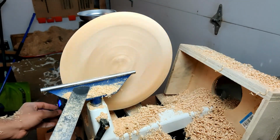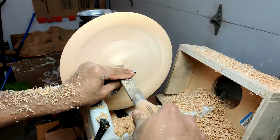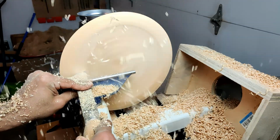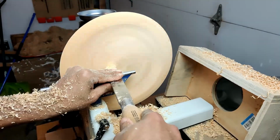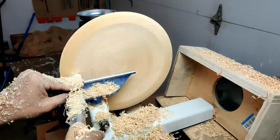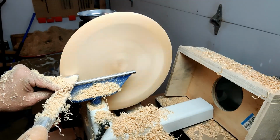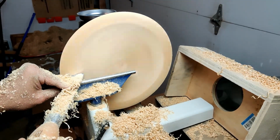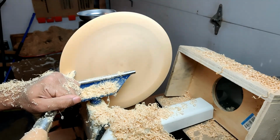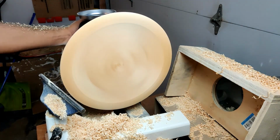For those familiar with turning tools, you might have used a standard scraper before. This is the same tool. The only difference is that this standard scraper is thinner than most. That's because I only use it for surface scraping and I don't need the stability of a thicker scraper in these applications. Fun fact, this actually used to be a skew chisel that I've repurposed into being a standard scraper. I've seen other masters do this previously and it has worked well for me.